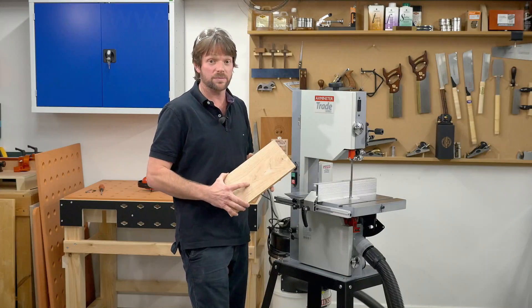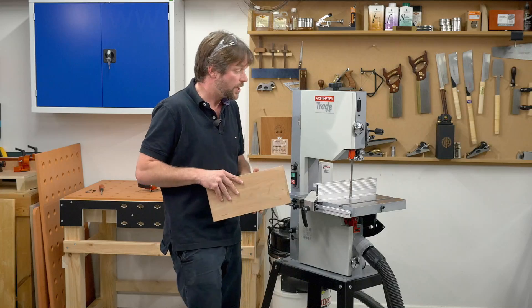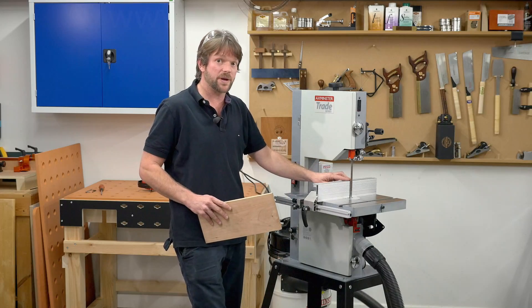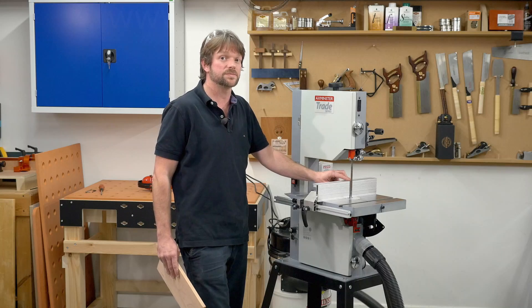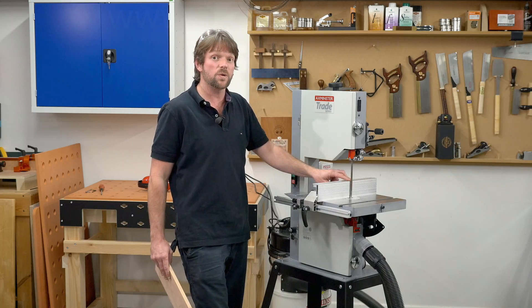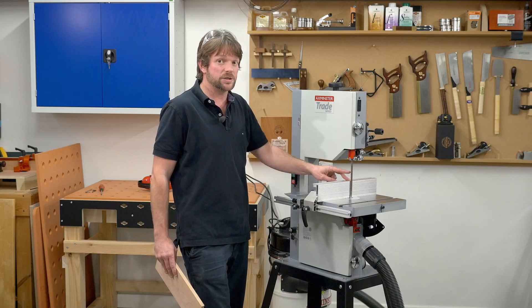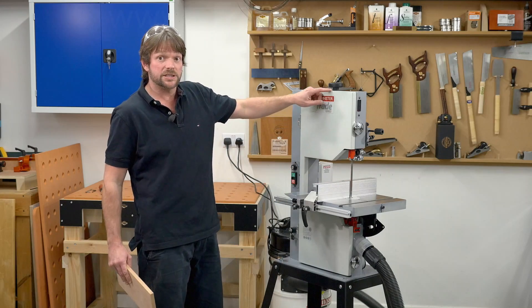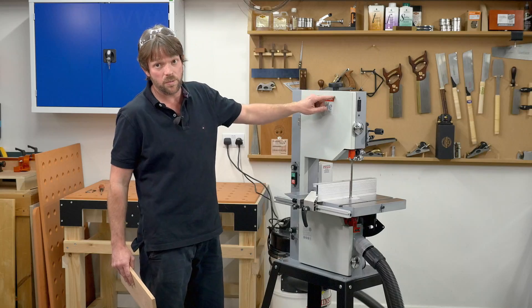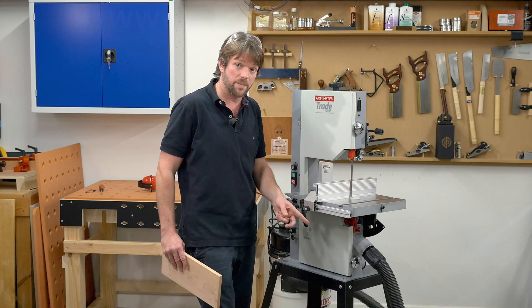Let's be cutting some hardwood now, so we'll cut to its full capacity — 160mm. The blade we've chosen is a GT blade, which is a ground tooth blade, and this will ensure really clean cuts. This particular blade is a 4 TPI, which is 4 teeth per inch. These deep gullets will ensure we clear the waste. The blade has been positioned so it rides right on top of the crown of the wheel, and the blade guides have been correctly set above and below the table.